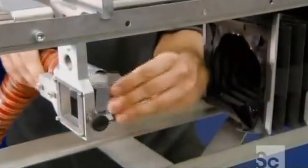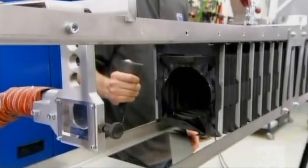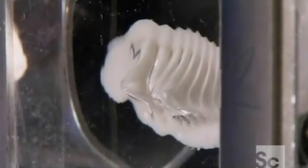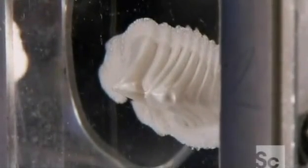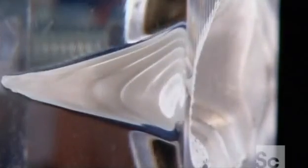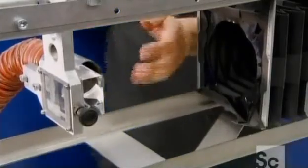For the laser beam to cut well, it has to be the right shape, but the beam is invisible. So to see its shape, they have to shoot it into a plastic cube and observe the formation it makes. They gradually fine-tune the beam's shape by adjusting the mirrors on the resonator. They keep at it until the laser cuts a cone formation in the plastic.